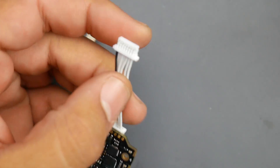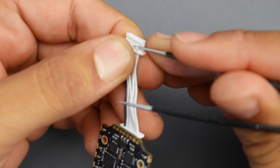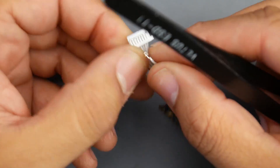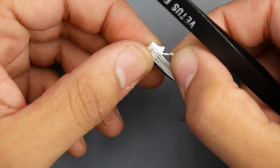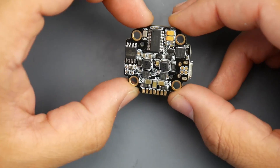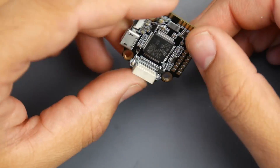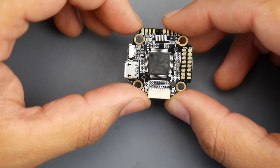If you don't know how to reroute these cables, it's very simple. You have these little plastic connector tabs here - just lift one up and you can pull the wire right out. Don't pull back too much. Then you can drop it into the correct position. This is how you change the wires without having to re-solder or cut them. I'm really impressed with the amount of features this thing packs for the price - I'm sure they could have charged 60 bucks and people would still buy it. Everything is linked down below. Let me know your thoughts in the comments, and I'll see you in the next one.